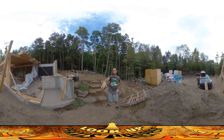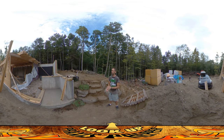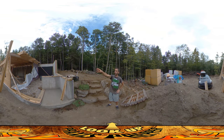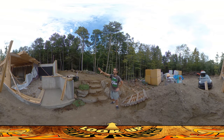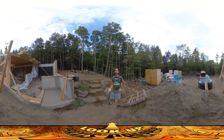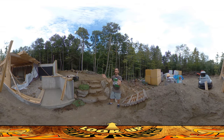You can see off to your left — all that white plastic is covering a bunch of stucco work that's on the interior part of the greenhouse. I did everything that I had gotten bolted down with the Tapcon screws. I guess we'd forgotten to do the top sections of each of these on both sides, so I did everything I could up to there and then called it on that. I did just a little bit of interior stucco work — parts of the foundation that are going to be visible from within the inside of the house. I just wet the wall down and then did just a layer on it.